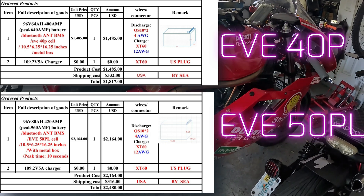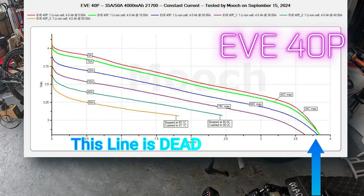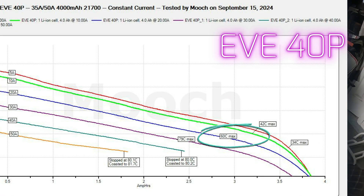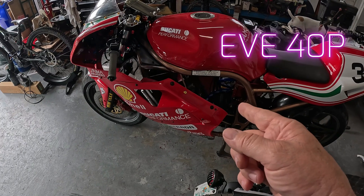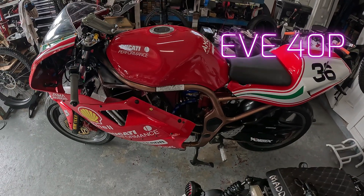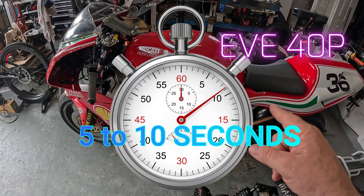That's all right — we're going to math it out and do it right. To run this battery continuous until it's dead, that EVE40P cell, you can't discharge it at a higher rate than 20 amps or it'll get past 60 degrees Celsius. That's the shutoff point in the BMS. We don't want to heat the batteries up higher than 60, so we'll use 20 amps. 20 amps times 16 gives me 320 amps continuous, which equates to about 600 to 800 peak amps for a very short time when you start looking at the heat and voltage sag.